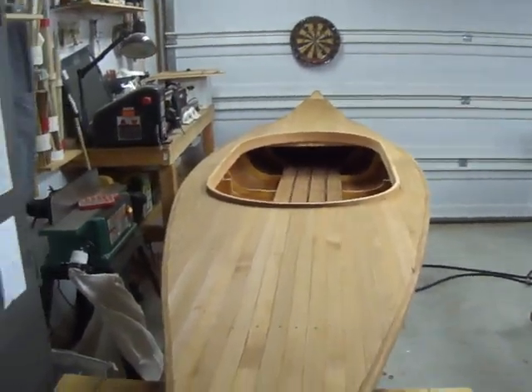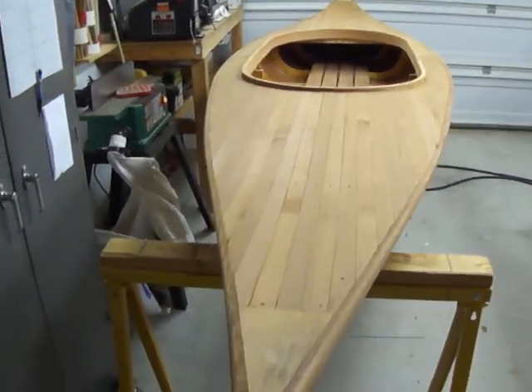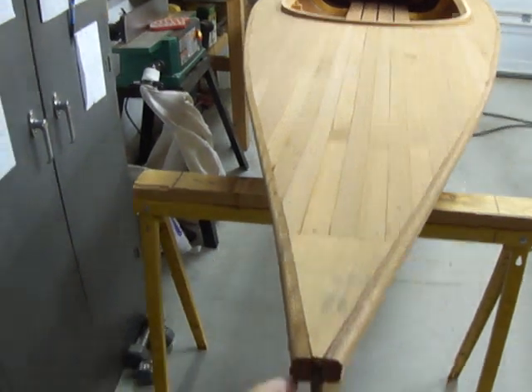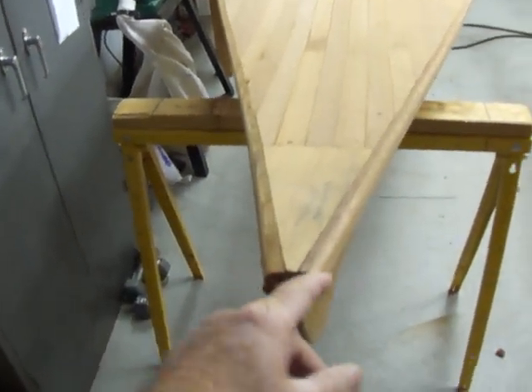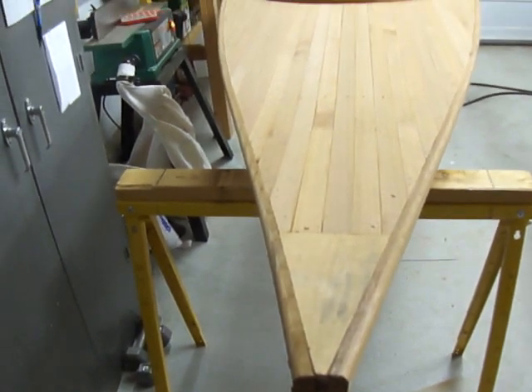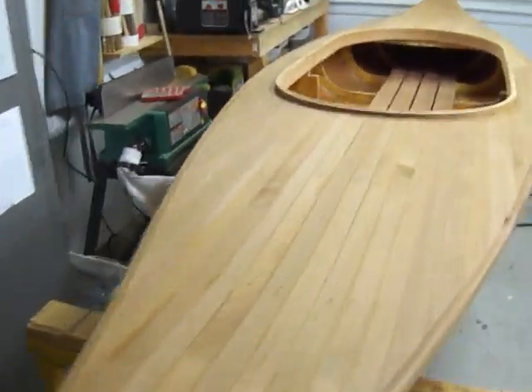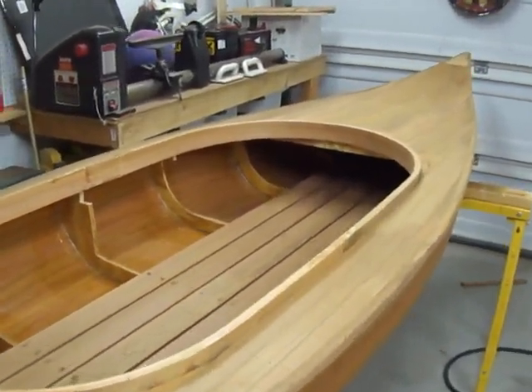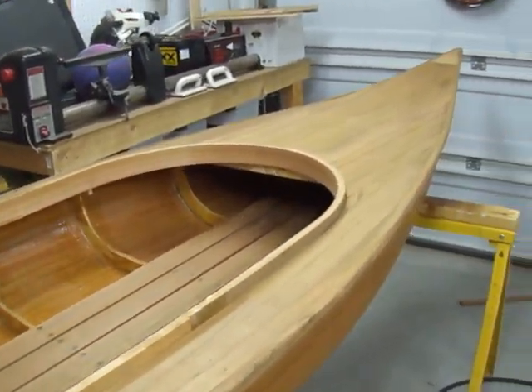And this is what we have to do on this end. This is going to be sanded and rounded here. I'm going to sand and round that, and I'm going to put a bolt through here. Then I'm going to cover it all with fiberglass. Just about done — once I glass it, I'll throw the oarlocks on there.